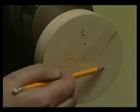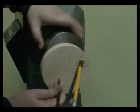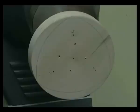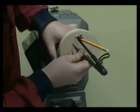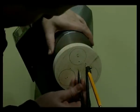You will now have four centres marked on the face: one true centre and three offset centres. Next, mark an arc using compasses from each offset centre to just inside the outer diameter of the bowl blank. These marks will give you a guide to the outside shape and size of the finished three-sided bowl. Now draw three circles from each centre, ensuring that there is a gap between the circle and the arc. These circles will indicate the position of the three parts of the clover leaf. Now mark the circle for the centre dish of the bowl.